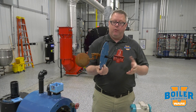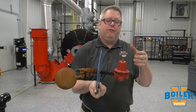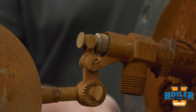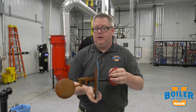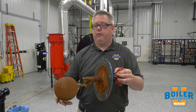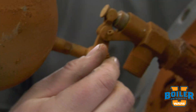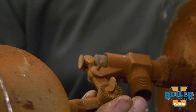One important thing to mention is a pressure reducing valve. If we bring too much pressure into this float valve, it's going to bleed through. So by having a pressure reducing valve on the inlet, we can maintain maybe 5 psi and the float doesn't have any difficulty functioning correctly. To change the level in the tank, we simply loosen the set screw for the float angle and tighten it.